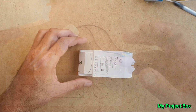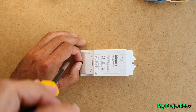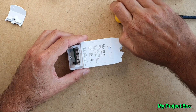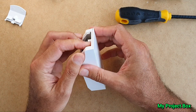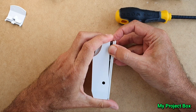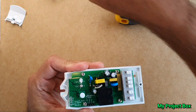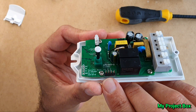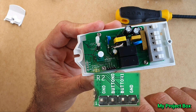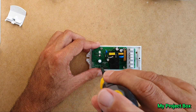So let's open this little sucker up and have a look inside. The cover just pops off rather easily because Sonoff do intend you to open this thing — you can actually control the switch inputs on this header here. They don't solder the header pins in; you have to do that yourself. But it allows you to connect switches to these inputs to control the relays manually without Wi-Fi control.